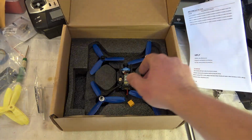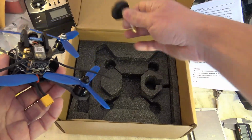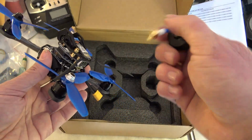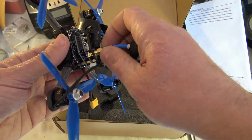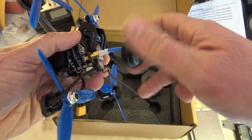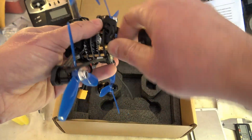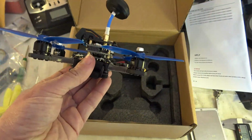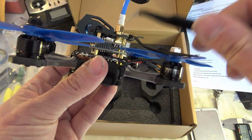And first, we don't have any battery coming with it, so you will have to provide yours. I will start with the 5.8 GHz antenna with an SMA connector, very short, okay, it's a clover leaf and there's no sign of a right or left polarization, so you will have to guess what it is. I guess it's a right polarization. So I will first connect it, and before, to be sure to not cook the video transmitter in case I'm turning on the machine. So here it is, and you can see immediately that the SMA connector is first installed